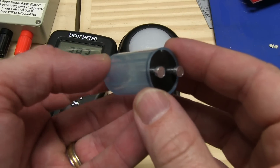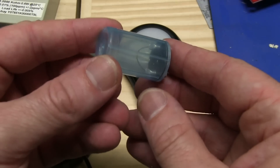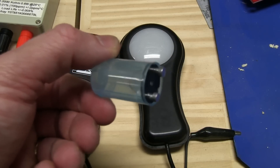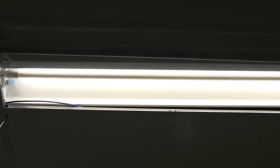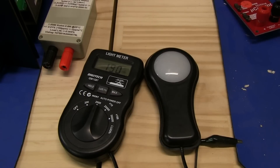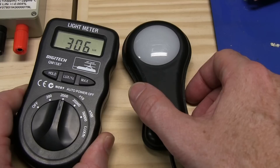When you install these LED tubes you get one of these little shorter starters — it basically just replaces your existing starter with a short inside, as explained in the previous video linked below. I had the lights out when replacing the bulbs and couldn't quite see the orientation, and of course Murphy's Law — I got it in back-to-front with the light shining up into the trough. Just need to rotate it so it points down. With it facing up into the trough I measured 135 lux; rotating it correctly brought that up to around 190 lux. Don't install these upside down.